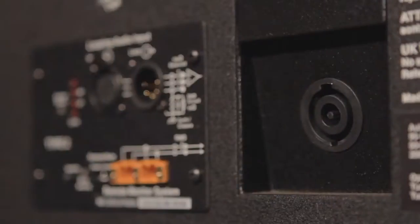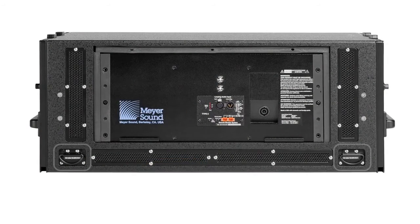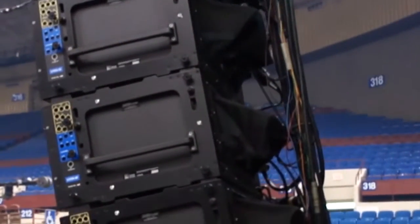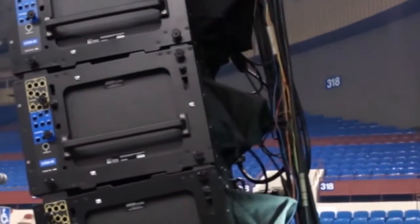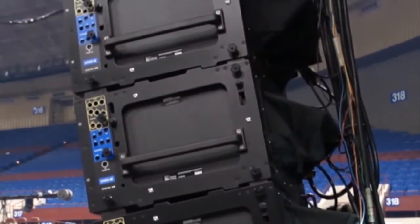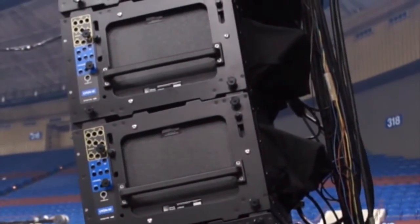Attach the cable pick and make the power and audio connections to the loudspeakers. The cable brackets are used as strain relief for cabling. They are not rated for any rigging use. Inspect the rigging elements to make sure they are taking tension without binding or twisting, and that they will not crush any cables as weight is taken. Confirm proper cable connections and make sure that there is enough slack to avoid excessive tension.